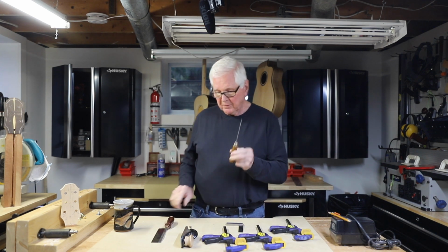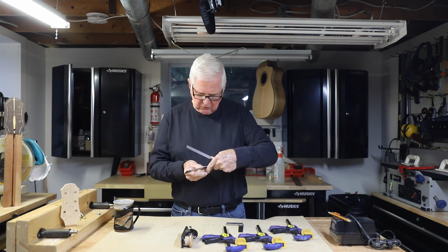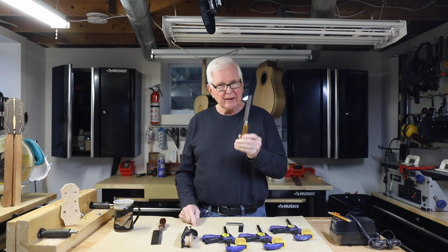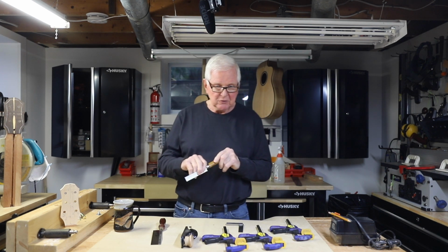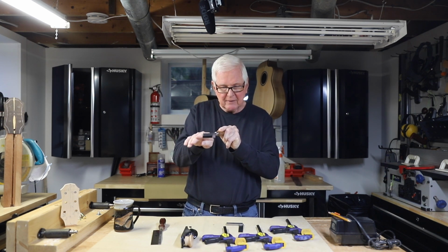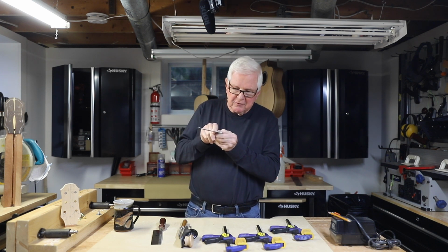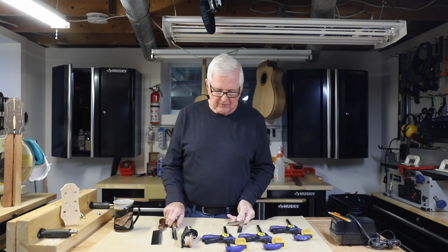This one is thinner. I forget how many teeth it has. This is 24 teeth per inch. This is way more teeth per inch than that one. And this could be used for fret slots. And that's how I did my fret slots initially. Now I do them on the table saw. But you would just simply put it up here, make sure you get it right against there and it's vertical, and away you go. The neat thing about this square, it's a little offset. So when you put it onto the wood, it's raised a little bit, which guides the saw very, very nicely.